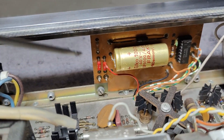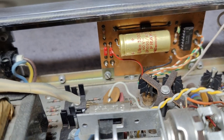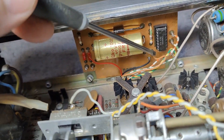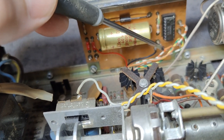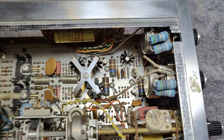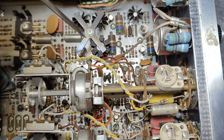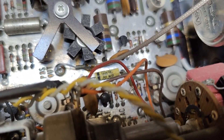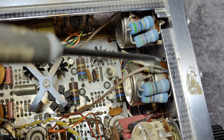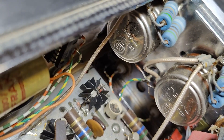Obviously this board can run on AC, so we have two diodes, then a capacitor and a zener diode resistor — a little local filtered zener. And then there's a little capacitor and resistor, some timing that generates positive and negative signals out of one trigger signal — really funny. This unit is normally designed to have rise times in the 5 nanosecond range, so it's really designed to be fast. This is why you see the outputs going in coax — it is of course 50 ohms. Then we have attenuators using two potentiometers and resistors, and then coax output that goes all the way to the BNC connector. That is how it should be done.